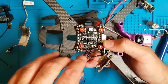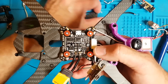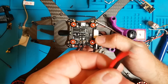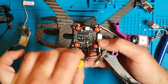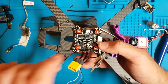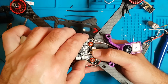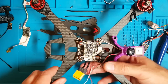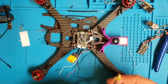I've tinned up pretty much everything on the Wolf PDB because it's always handy to have, and it's a pain having to undo everything if you decide you want a pad you haven't tinned. I've mounted my XT60 — I tend to have mine really short, some people prefer longer, whatever floats your boat. I'm using 16 gauge wire because I always do. The Wolf PDB comes with a nice XT60 using 14 gauge wire, so I've just desoldered it because I find thick wire really irritating, and I've never had any problems with 16 gauge even on 6S.